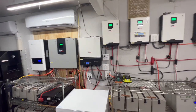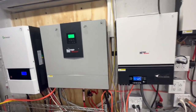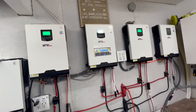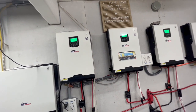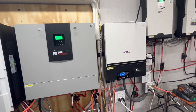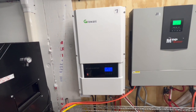When that happens, we'll more than likely lose one or maybe two of the other inverters on the wall — possibly these two right here. I want to stick with the 24-volt units because they really don't use anything overnight. Just from the inverter they use maybe 5 watts, whereas this one and this one will use 50 to 100 watts in standby mode. And this one is like 150 watts in standby — it's hard to run overnight, it drains my battery.